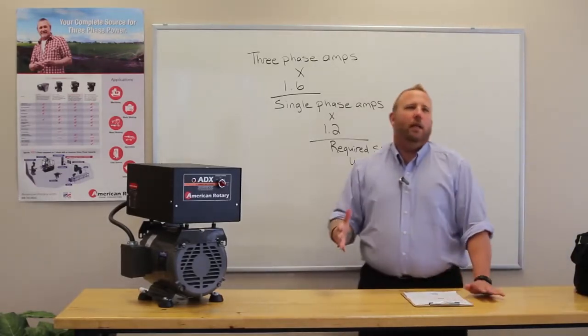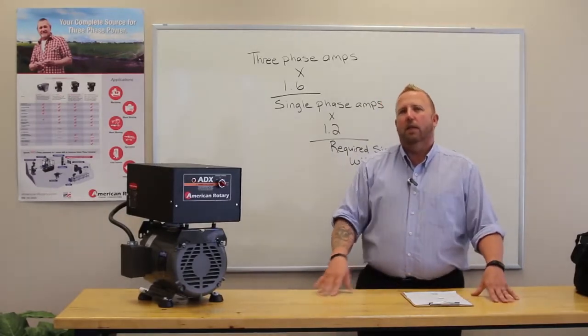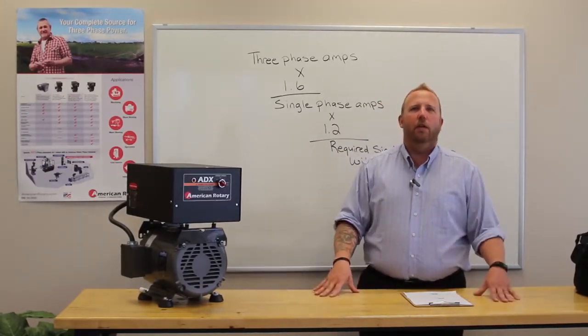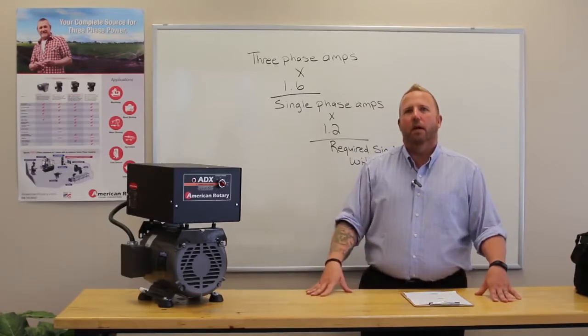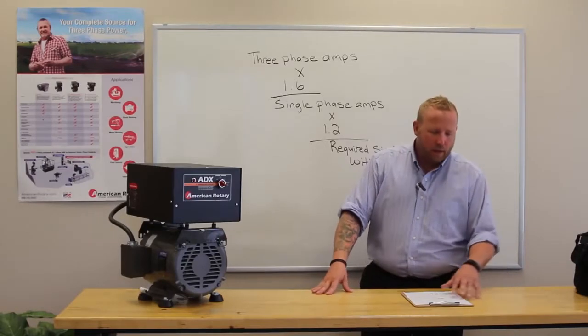Why do we calculate in that 20% adder, you ask? Well, the reason why we do it is most cities require you to have 20% above what your load is. So we just build that in there as a little bit of a cushion for you.